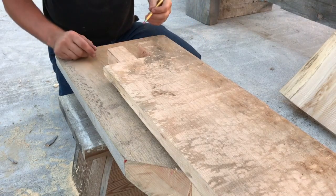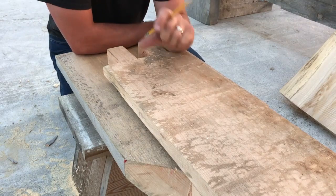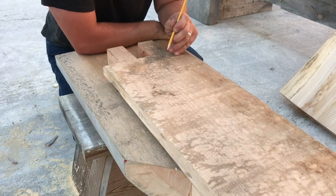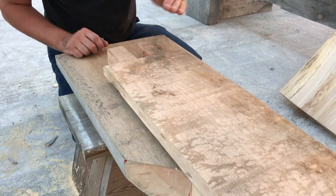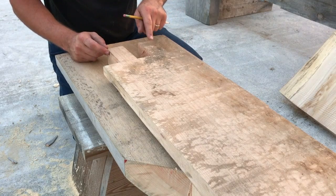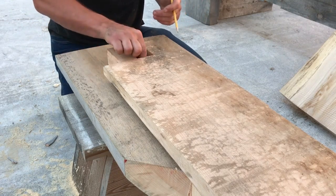So what I want to do is try to make a short tenon to sit into a couple of shallow mortises, but do a half dovetail on one end and wedge the other end, and then shape it so I can round it off, come over the top, then we could drive a pin around the outsides. This right here was a little ill thought. I should have done this different, but we're going to go with it. We have it now. I think we can make it look nice, do all that good stuff with it.